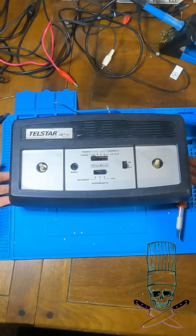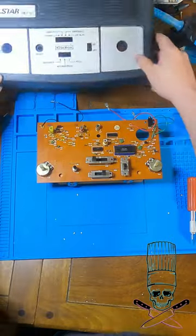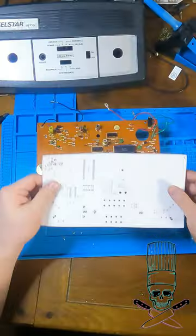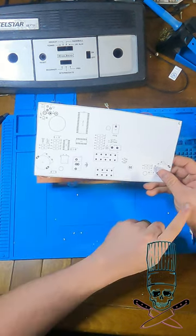If you're in the process of rapid prototyping and you don't have time to wait for boards to arrive from China over and over again, here's a quick tip for you. When you go to print in KiCad, you can set the size to 1 to 1 and set it to print mirrored. You can then use it as a template on the back of the PCB that you're modeling and see if all the solder points are exactly where you need them.